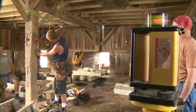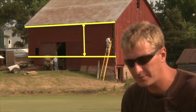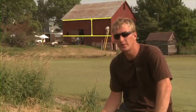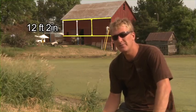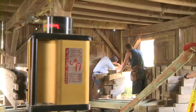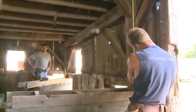We set up a laser that spins 360 degrees to create a level plane. On the east side of the drive bay, on the north and south ends of the building, we dropped our tape down from the top of the rafter plate. The south end measured twelve foot one and three quarters and the north end measured twelve foot two and a quarter. We split the difference, setting our number at twelve foot two down from the top of the rafter plate. With six lifting points, you measure down from the rafter plate at each point to your laser line, and it tells you how far you need to go up.